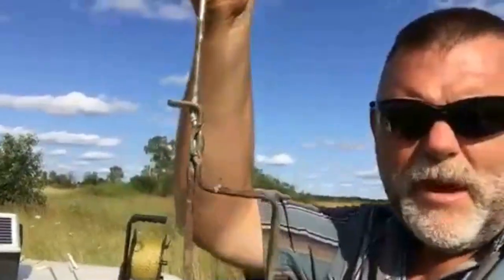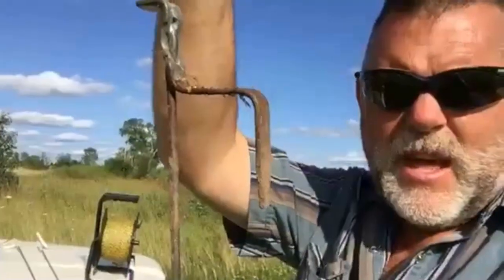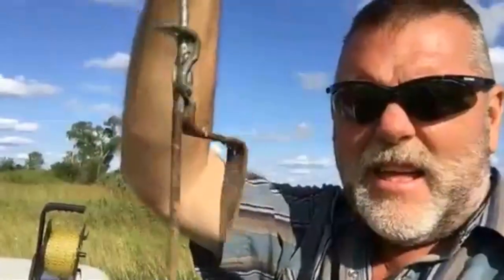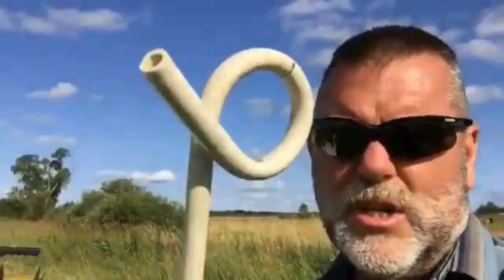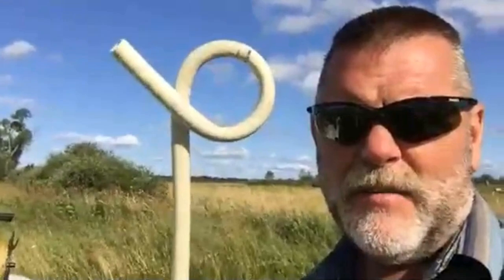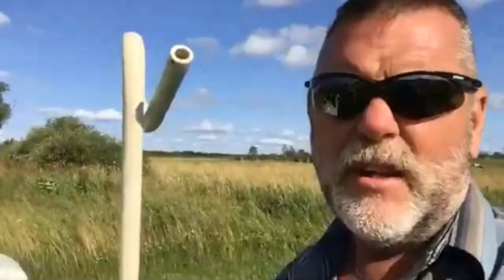They have a little step-in on them. See that? I can put that down on the ground and step that in about a second. All right? And it's steel. These were about $2, right? And that pigtail on there is to hold the wire. And the white stuff that's on there is an insulation from ground.